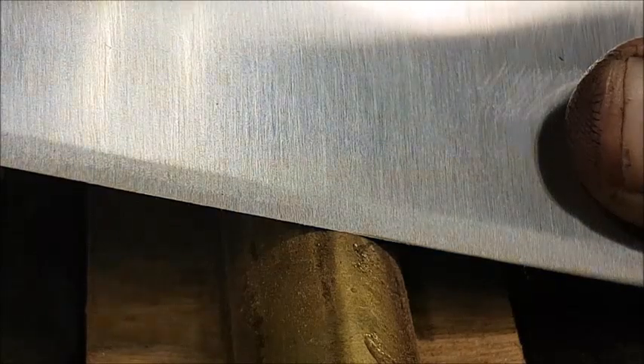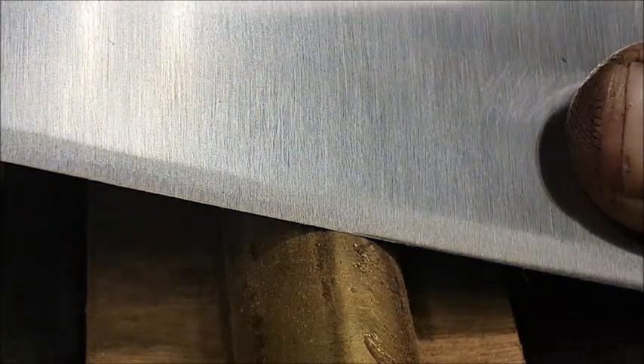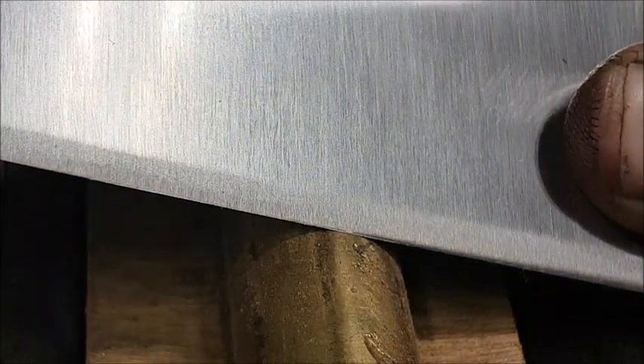You're going to take your knife that has been sharpened but not finished. The reason we do it not finished is in case the edge chips — you may have to re-temper, and then you may have to re-grind as well.